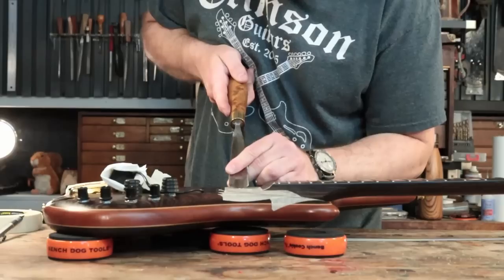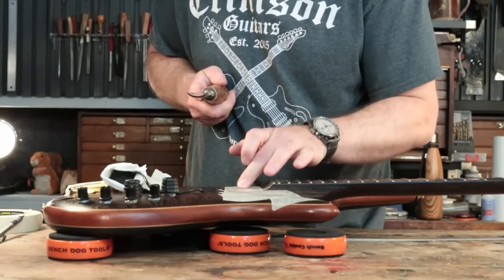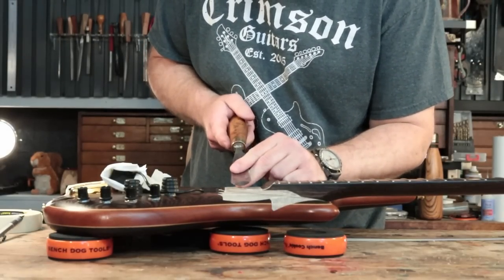because I wanted to. I'm cutting directly across the grain, so I've made this very sharp. It's hard wood, so I'm going to be smacking it probably with a mallet, and that gives you a lot more control. If you are pushing with your hand, you can't stop. If you've got short, sharp blows, you're stopping every 2 or 3 millimeters, depending on how much welly you're giving it. So we're going to do that. And cutting across the grain also means that I am not running the risk of hitting a soft patch and just shearing off a load of material.